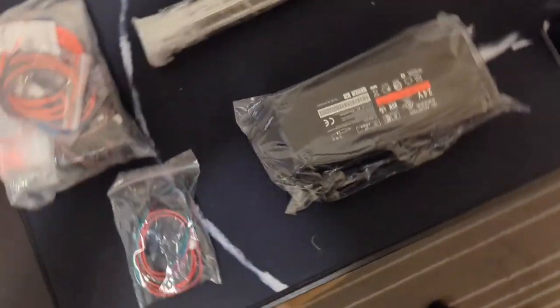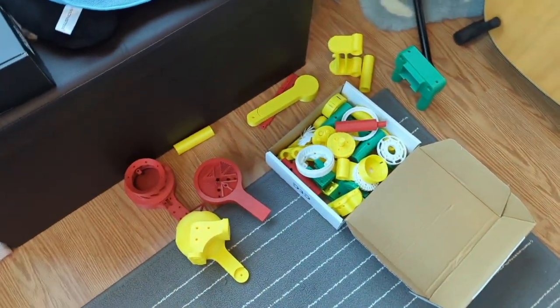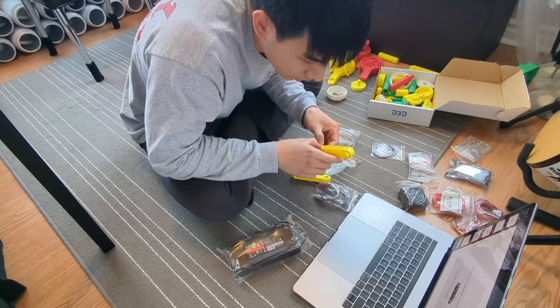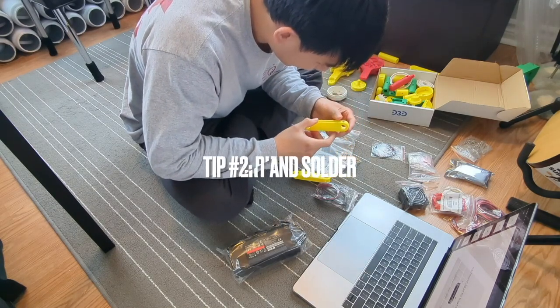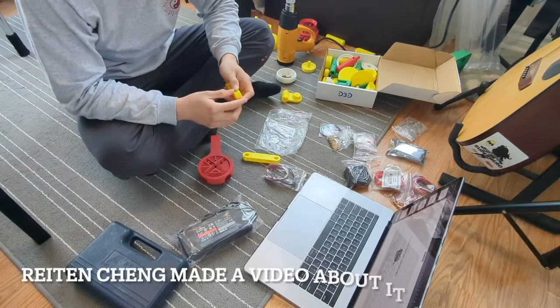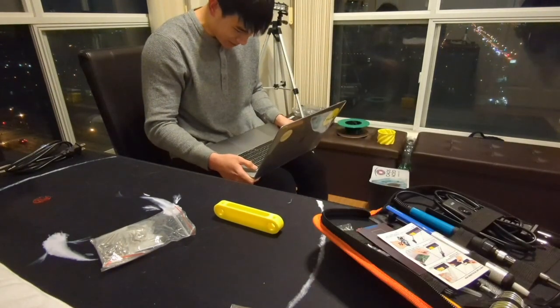With all the parts here, it's all assembly from this point. The first thing we do is the electronics bracket sub-assembly. The guide says to install with a soldering iron — we were already stuck on day one after encountering something called a heat insert. Heat inserts were actually pretty simple, but as a newbie who had never done this before, it was a little nerve-wracking. Time to learn a new aspect of 3D printing. The heat insert leads at around 225 degrees, so we set it to 225 and wait until the temperature is high enough.